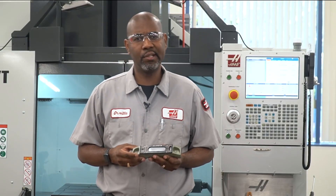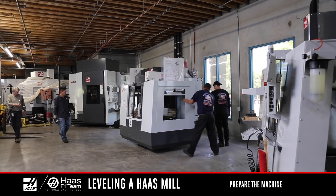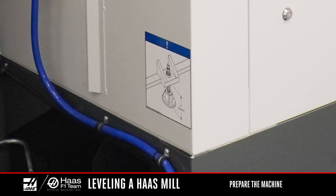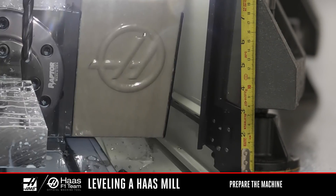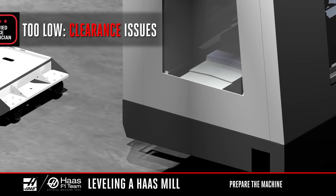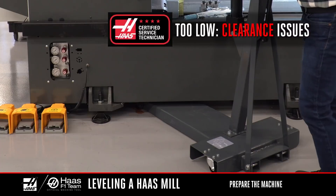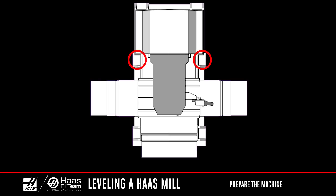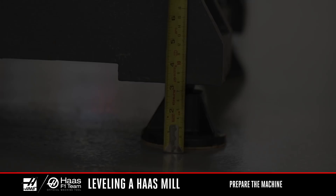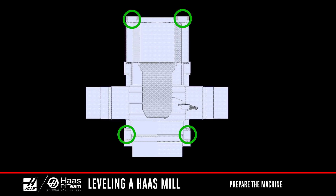We recommend a machine is leveled with two vials. When a machine is installed, it must be leveled to a certain height to provide optimum performance, accuracy, coolant, and chip flow. We'll start by making sure the machine is at the correct height as specified on the decal. If the machine is too high on the pucks, there's a risk of excessive vibration. If it's too low, you may have a problem getting the coolant tank in place or not be able to get the wheels of a forklift under the machine. The middle screws should not be touching the leveling pads at the beginning of the leveling process. For this machine, we're going to maintain three inches from the ground to the bottom of the castings on all four leveling screws.